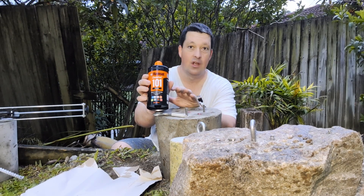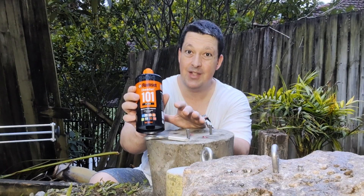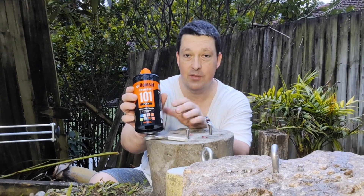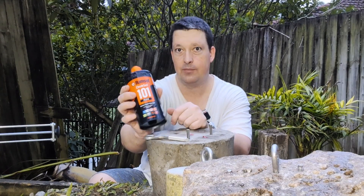As we've seen in previous videos, polyesters can be strong enough for this kind of application, but they tend not to last very long. They can degrade in as little as five or ten years, and then you're left with basically sandy crap in the hole instead of good glue, and your bolts can fall out.